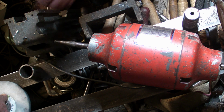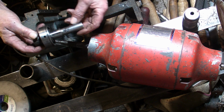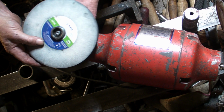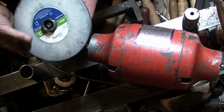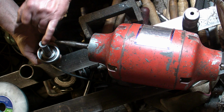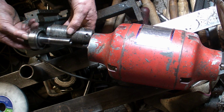So I have got this grinding arbor that I'd modified in the past to fit into one of my ER32 collets. Now, that's an inch and a quarter across the top, so that is a direct fit for an inch and a quarter diameter wheel. There's a collar that screws onto the top of it. So that solves the problem on this side of mounting a wheel, but there isn't enough wall thickness in this to machine that down to fit onto this straight shank. So I need some kind of adapter to transfer this onto this.